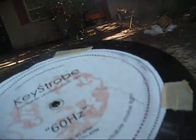Now, I've heard of people downloading an app on their telephone to check speed, and personally I don't have a phone that fancy, don't want a phone that fancy, but the way I see it, that phone may weigh so much that it might bog down the drive mechanism in your motor on your turntable. So I really think the best way to adjust the speed is with a strobe disc, and having this disc attached to an old record kind of helps, because with the record on the platter, that adds enough weight that what the platter would be seeing with a record playing.